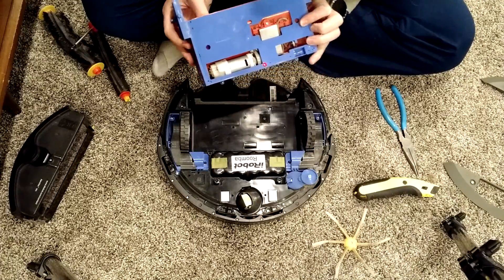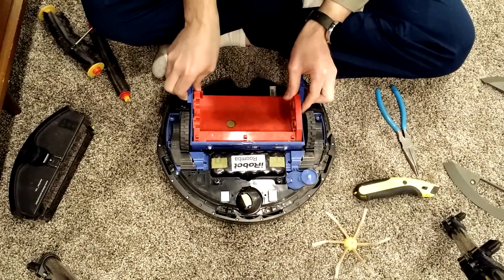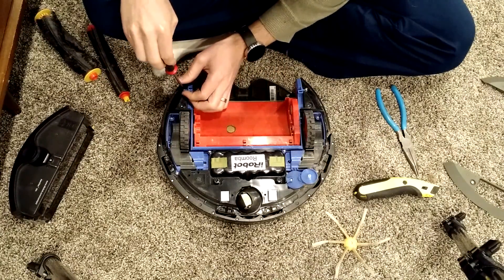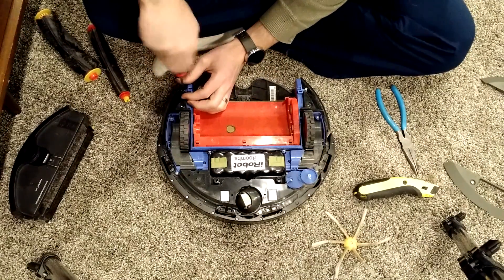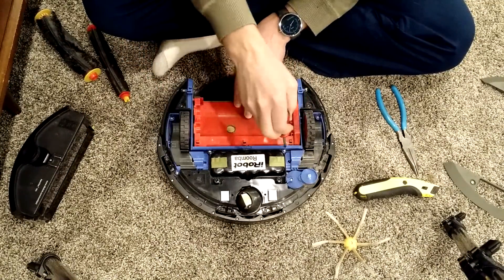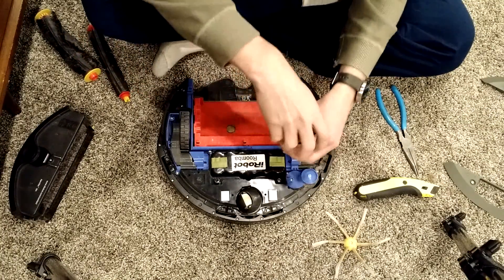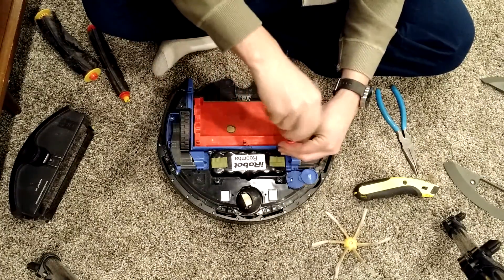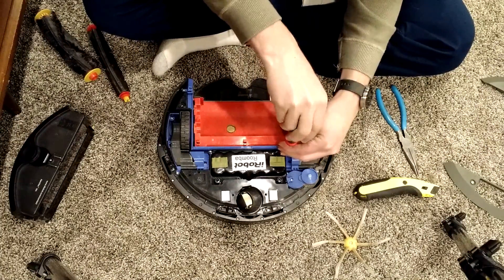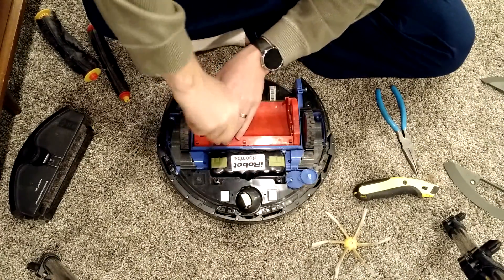You can tell which way it goes because this has to go into there, so it goes like this — pops the screws up. One little trick I've learned: when you're screwing something in that has screws at various areas, don't just screw them in sequence. If you sort of screw one in here, one in there — kind of like doing a tire — it helps make sure the thing goes in flat, and you don't strip screws or get holes misaligned.